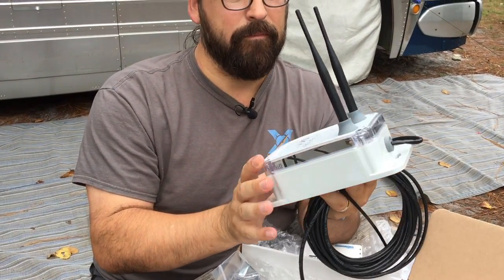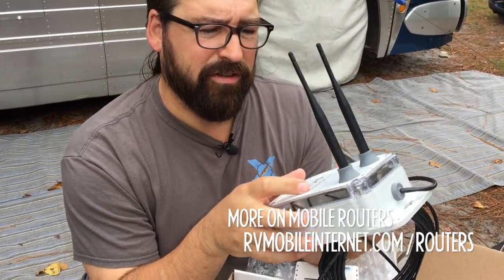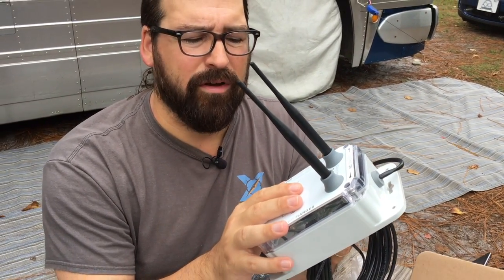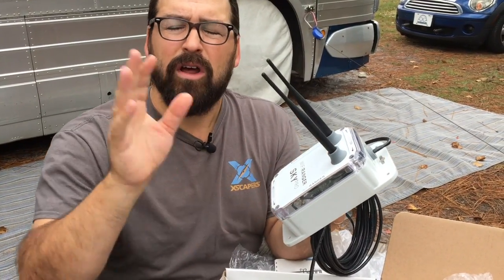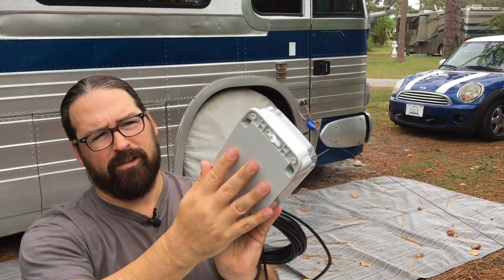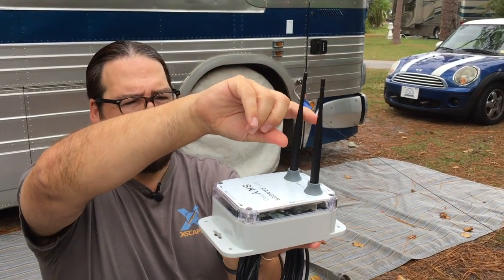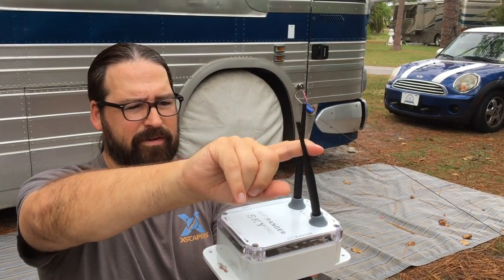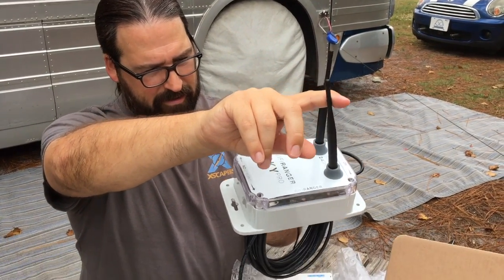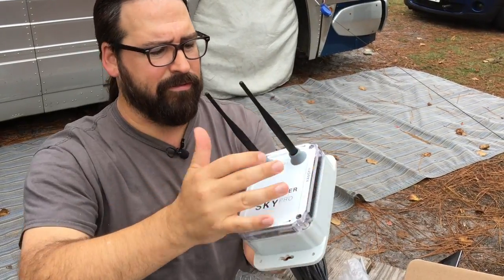These are Wi-Fi only antennas — they are not cellular. They are claiming a range of 1.5 miles. This is only 2.4 GHz Wi-Fi, which is what you'll find in basically any public Wi-Fi in a campground or anywhere else. It's not 5 GHz, it's not 802.11ac. But for long distance on your roof, that is really not too important. This is a relatively low-profile unit. You could seal it down with some sealant onto your roof, or attach it with zip ties to a piece of conduit. New for them is that these antennas have some give, so they can survive getting whacked by trees in a campground.